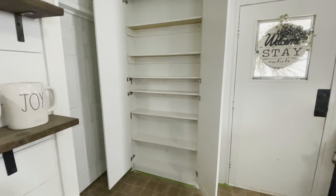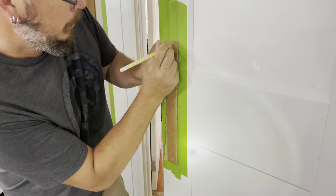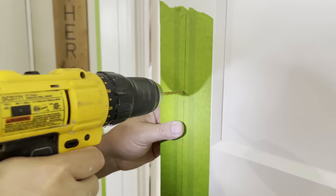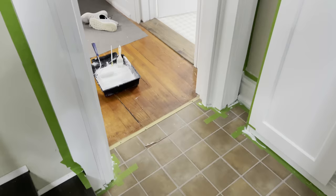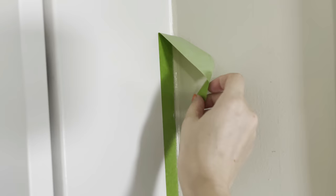Here is what it's finally starting to look like. I needed to add some more paint to the shelves, but lots of awesome storage is happening. We also purchased IKEA handles to add to the fronts, but they didn't come pre-drilled. A little tip: add some painter's tape to the front and backs of your finished wood so that you don't get a ripped or blowout effect — you'll get a clean drilled hole to install your handles. I also taped off all the trim. Once you start touching up paint it's that snowball effect — not only did I paint the wall but also the trim. And there is just something so satisfying whenever you remove the tape to reveal that clean line. Pull off your tape before your paint has dried so that it doesn't start peeling paint off with it.